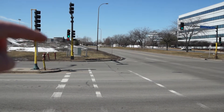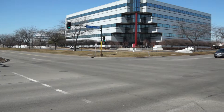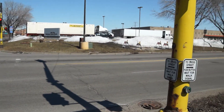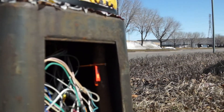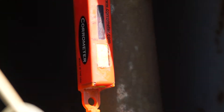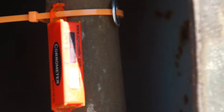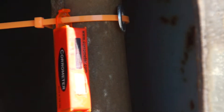A lot of these electrical boxes here — if you've got underground bunkers and storage areas that are controlling telecom or traffic signals, they're going to have problematic times in the summertime because of high relative humidity, and in the wintertime we've got all this road salt. So even though we're in the Midwest of the U.S., far from maybe an ocean, we still have our areas of high corrosivity.